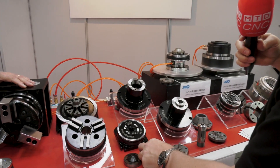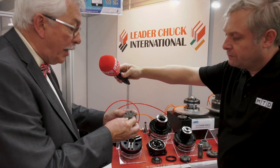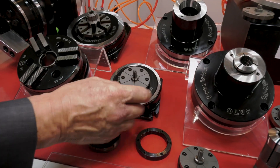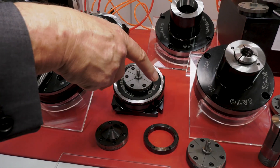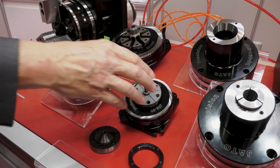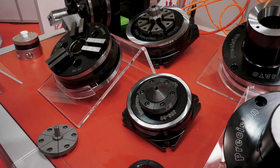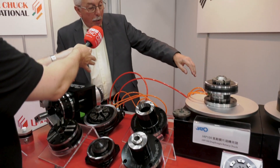You've got these systems here — I presume these are the fixture-in plates? These are the jaws. This particular jaw is for holding internally. The jaw goes on top of the chuck, bolted in. Once it's under pressure, you would reverse the system because you're holding internally. This is an example of external gripping.